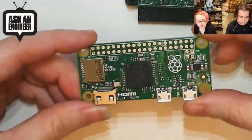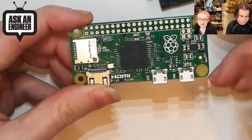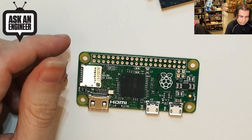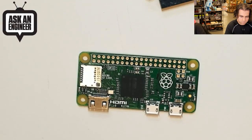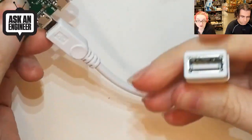What's different compared to the Raspberry Pi B+ and A+ is of course it's smaller. The Pi A+ is like this big, and the B+ has ethernet ports, USB ports, and ethernet port — this doesn't have that. This doesn't have ethernet; it doesn't have built-in WiFi. It does have USB, but instead of having a USB-A port, it has an on-the-go style port. To keep it small and low cost, there's a micro USB port — use an on-the-go adapter and now you've got your standard USB port.